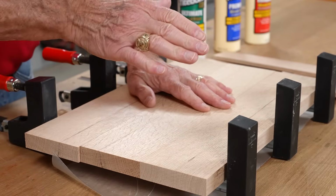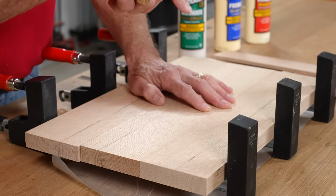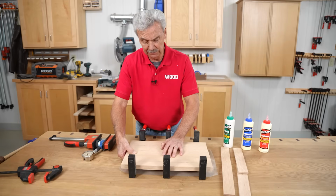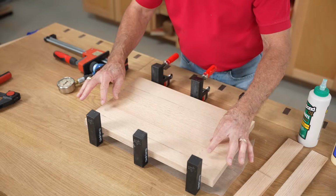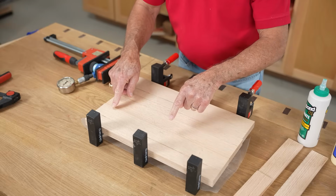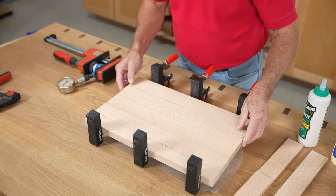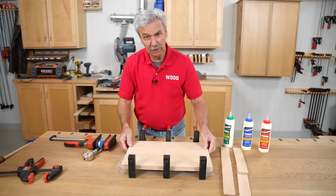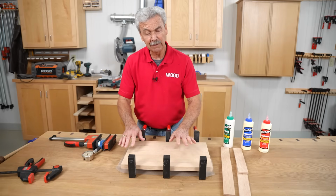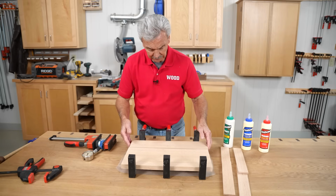And that's where we see a lot of woodworkers set a second set of clamps on the top to try and tighten it to push the bow back down. Or they use some spring clips on the side to pull it down. By just using enough pressure to close these joints and see the glue squeeze through, that's plenty of pressure, well within the 125 or 175, that still gives me a perfect joint, but without all that tension. The boards stay dead flat and they'll stay that way forever. So here's how I glue these.